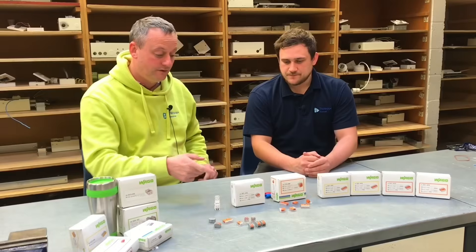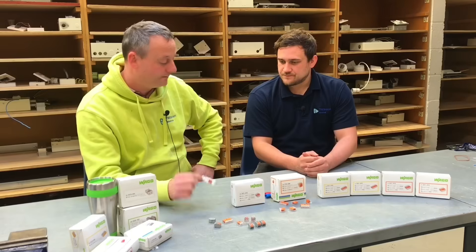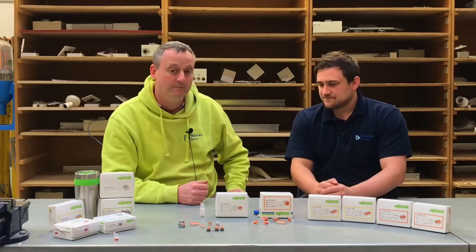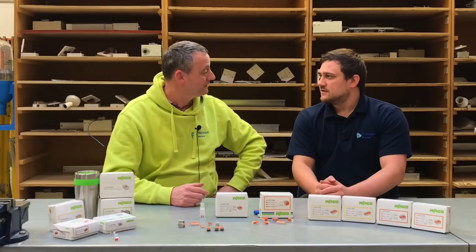The whole world is fully aware how clever the technology is behind the design of WAGO connectors. The 221s — anything about them you really like? I like the fact that they've now introduced that second testing point, it just makes it more convenient when you're testing. I like the fact that they've introduced this little carrier as well, for looping terminals in fluorescent light fittings where you can actually secure your connection. Thank you for clarifying how easy it is with the push fit on the 773s — just saved a few from being thrown away. We'd like to thank Michael Lane from WAGO for identifying the voltage issue. The lower voltage, 20 amps and 300 volts, is for Japan, and the higher voltage, 450 volts and 32 amps, is for Europe. We hope this video has been some help.